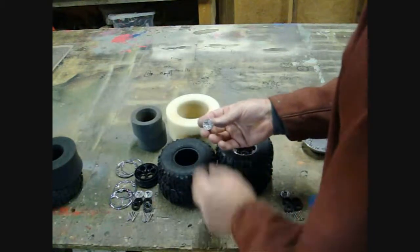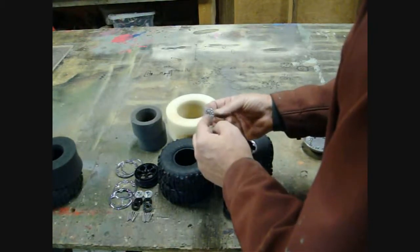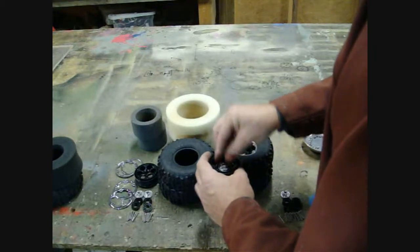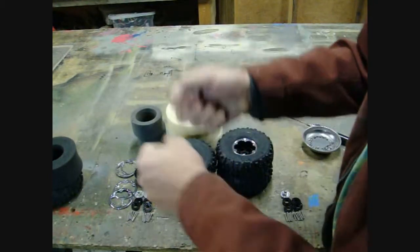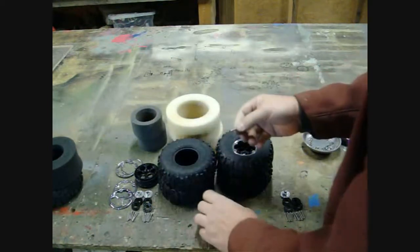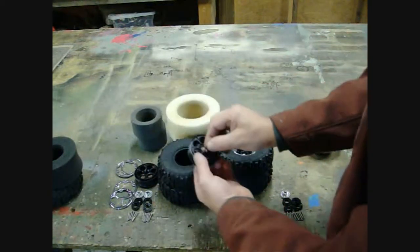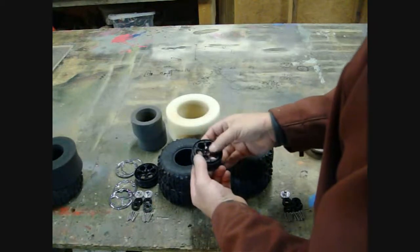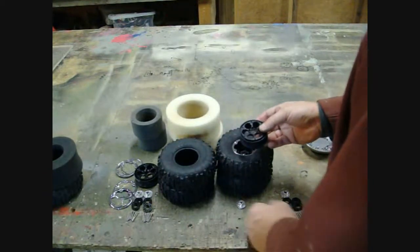Now they ship with, this is 12 holes, they ship with 6 of the holes done at 440, and 6 of the holes open, blank, so you could tap them to whatever. I've tapped mine to M3 and I use M3 to put it together. What I've done is I've taken M3 button head screws, I've put them in my cordless drill, and I've touched them to my belt sander, which you could also use a file, and I've just run the head down until the head will fit in this little space. This is perfect for a socket head machine screw, like a 440 or an M3 socket head machine screw would fit in there just fine. I didn't have those, so I made some. You don't need to do that. You can just get the right thing.